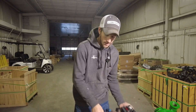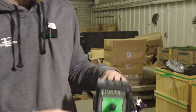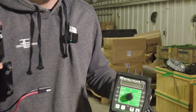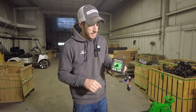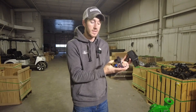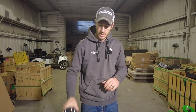It's the most trouble-free system on the market. From there, we can go to an auto rate controller — something like this Microtrack Spraymate Plus. It's very similar to a Raven 440 or 450. It's got three sections up top that are manual. This has got a speed sensor — as you speed up and slow down, it will automatically control the amperage to and from that pump to get more or less flow in gallons per minute. You type in your width, it reads your speed off of GPS, and you put all your data in. A whisker switch comes with this one to automatically turn it on and off. Electric: super simple and pretty reliable, as long as you're not maxing out that pump.